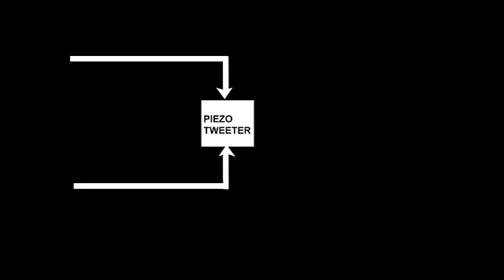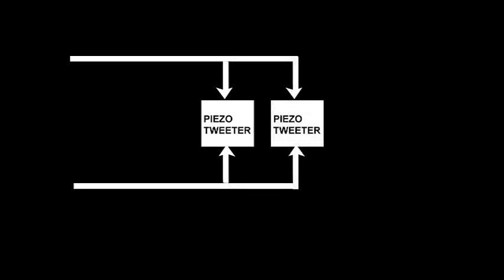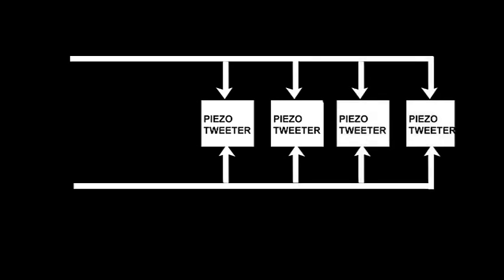Here's the point I want to make about piezoelectric tweeters: they're extremely efficient. They don't really require current, just some alternating voltage, and you can make a lot of sound. So they don't load down the amplifier very much, and you could hook a lot of them up on one line in parallel. And since they're pretty cheap, you could hook up several of them without much expense.